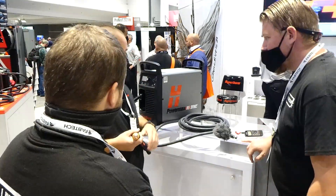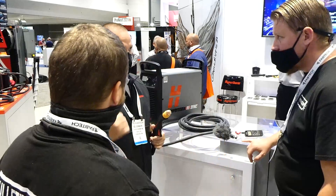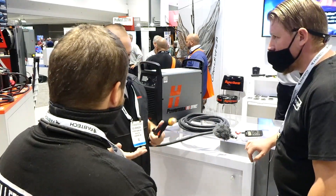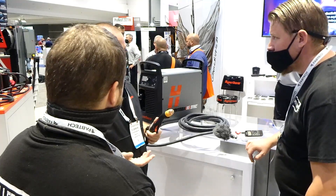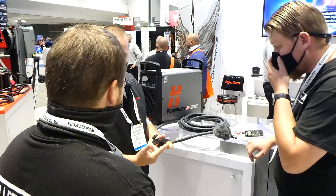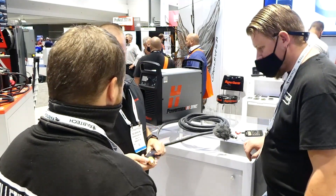If I have a 105 amp machine and I put the 45 amp cartridge on, it sets the machine to 45 amps. So when I pull the trigger, I'm going to know I'm cutting at the wrong power — I can just quickly look and see I put on the wrong cartridge. But you're not going to damage the cartridge, the machine, or the work piece. That's a big safety feature.